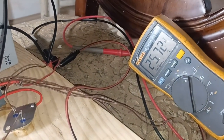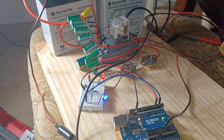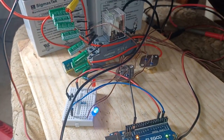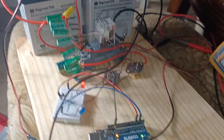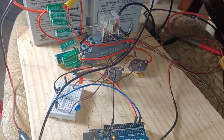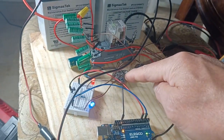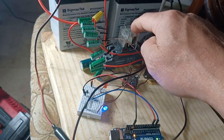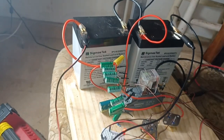That's your battery voltage running the circuit. The red LED is charging. There's two transistors — one is the red LED switch and one is the blue LED switch. The bottom transistor is switching the relay. The relay gets its 12 volts from one of these batteries.